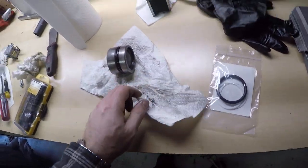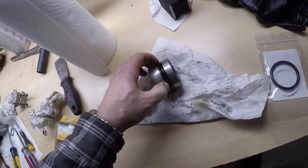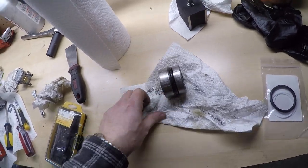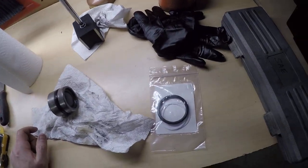The backup ring, I think, is a P50A — so the main O-ring is a 50 millimeter and the backup ring is a P50A. They're metric, so they shouldn't be that hard to find, although I didn't find a bunch of them on Amazon or eBay. They might be like a special order, but they're cheap enough.